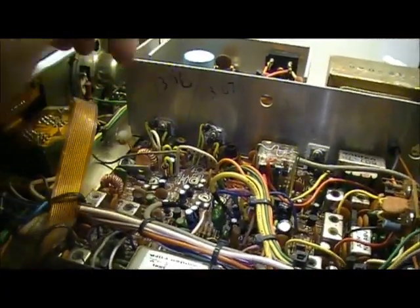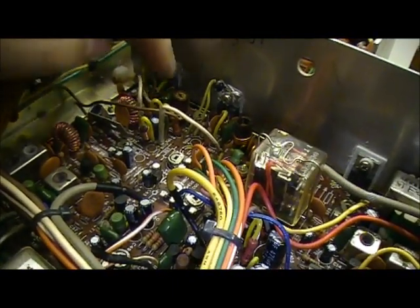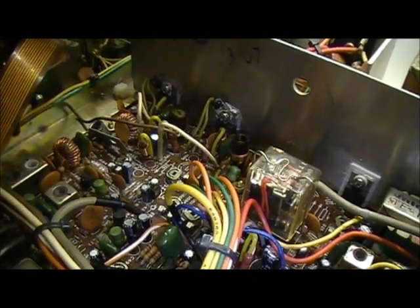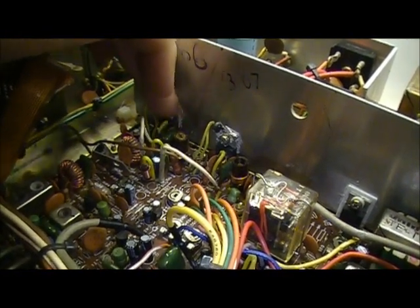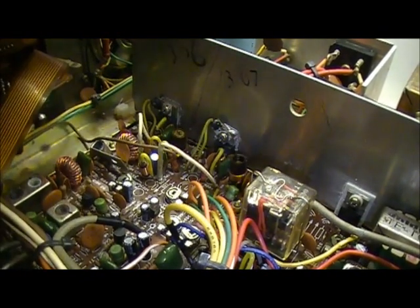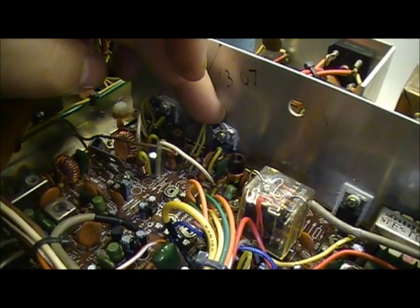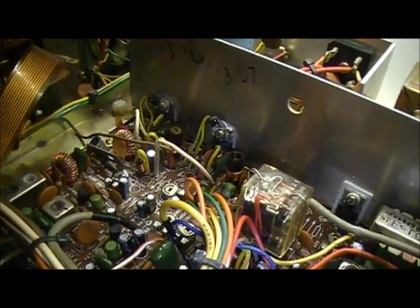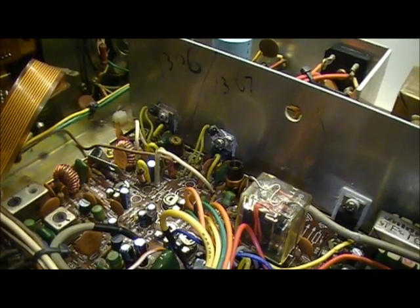Something when she's on transmit is drawing down the voltage. I put an RF probe between the driver and the final and there's lots of RF on the driver side of it, but on the output of the final there's hardly anything. The driver is generating lots of RF but it goes to the final and just dissipates to nothing. I don't understand it — it's almost like the final is blown, but it's not blown. I tested it and the final is good, but it's like something is shorting RF to ground.